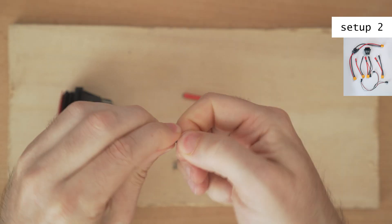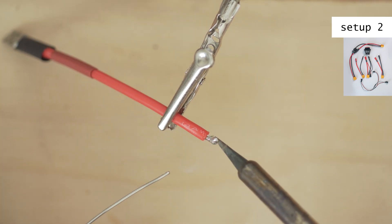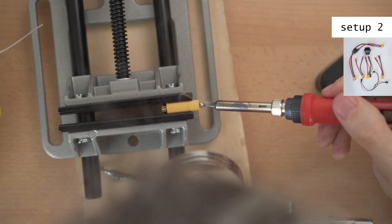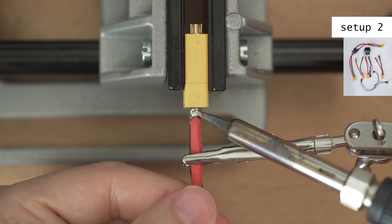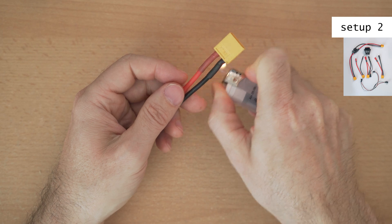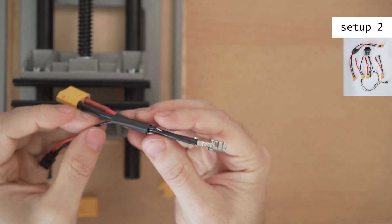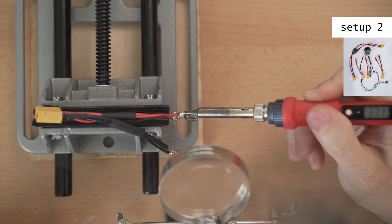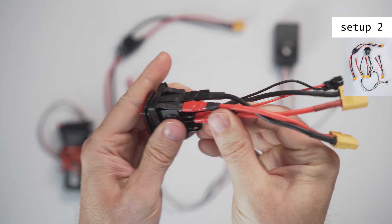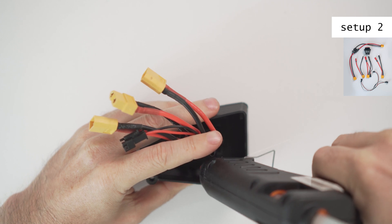I had to make 3 cables. The 2 cables going to the internal and external batteries are basically the same. I used spade connectors, which are common in cars and maybe not so wise to use in e-bikes, but I soldered them so I hope it will support higher amps. Again it is recommended to connect the XT60s so that they don't melt when soldering. I added heat shrink; this time I did not have AMS connectors. For the connection in the middle which goes to the controller I added extra cables to attach the bike alarm and the GPS tracker. I will not show how I crimped the JST connectors here — you can read about it in my blog or wait for my upcoming video about my controller upgrade. Now I just had to connect the spade connectors to the DPDT switch and put it into the 3D printed lid, using hot glue to make everything waterproof.